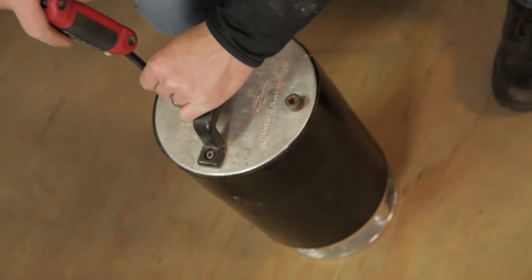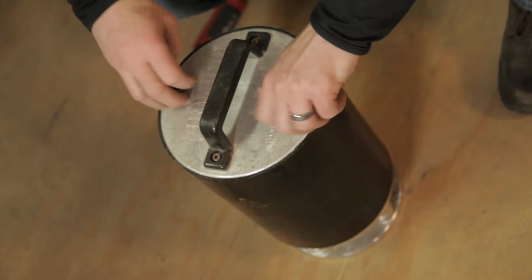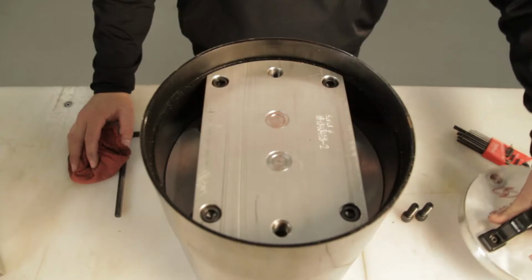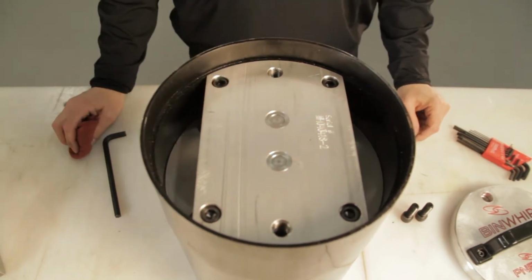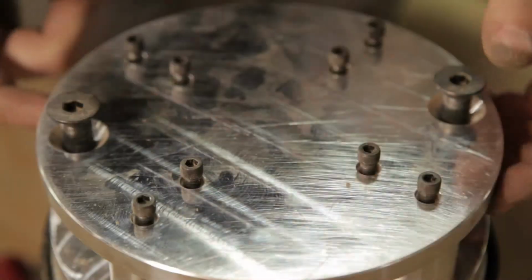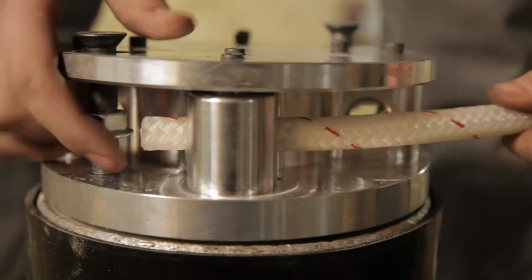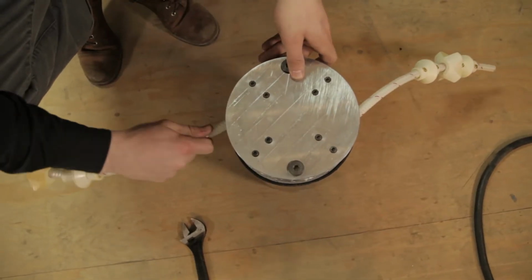Place the whip head near the hose assembly and proceed to remove the two socket head screws securing the whip head cover. Remove the cover and wipe the couplers clean on both the whip head and the upper receiver. To install a nylon whip set, loosen the socket head bolts until you're able to insert the end of the whip into the holes in the whip mount, adjusting them to the desired length, usually about 2 feet.